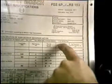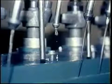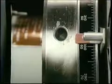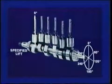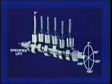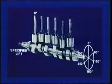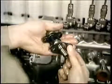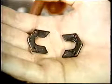In this case, rotate to number five and watch number five to see when it changes to drops — that's port closure. Hold it and read your degree wheel. Did you port close at 60 degrees? No, it happened at 59. Is that okay? No, the tolerance is usually one half degree plus or minus. In rotating one half degree, most cam lobes lift one tenth of a millimeter. Your port closure is one degree early, so you'll be adding two tenths when you change the shims of number five. You may remove the barrel to change a stack like this, or with split shims like these, you need only loosen the barrel. Be sure both shims are the same size, or you'll cock the barrel in the housing.